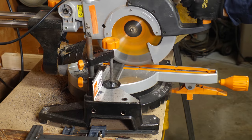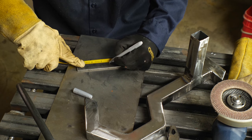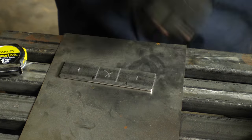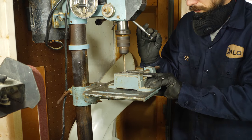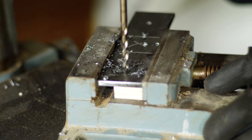The last piece to make was a mount to put on the wall — just a thick piece of flat steel. I found the center of this piece and from there marked out the square where the square tubing would fit. On the two ends, I split the difference and made a mark with a punch so that I could drill a hole. Over time I've learned to drill holes in metal a lot slower than I would in wood and use some oil to help keep the heat down.